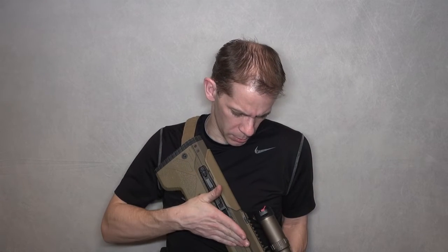It was very difficult to fix. I had to get the giant screwdriver that I use to adjust my gas valve out and eventually was able to get that cleared. If I had been in a gunfight, it would have been dead long ago. Then it went fairly smooth, and then the 162nd round crushed one of my rounds going in. I don't know if it's more of a double feed or just a failure to feed, but I've seen that a lot especially with my .308s and 6.5. And then around the 188th round there's also another one. So out of 200 rounds, two of them became unsuitable and unsafe to fire.